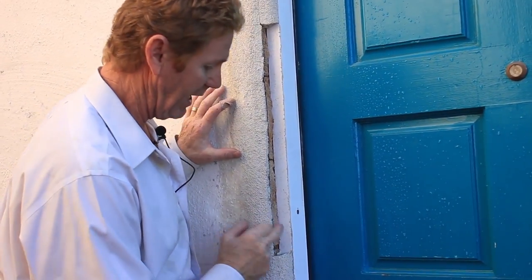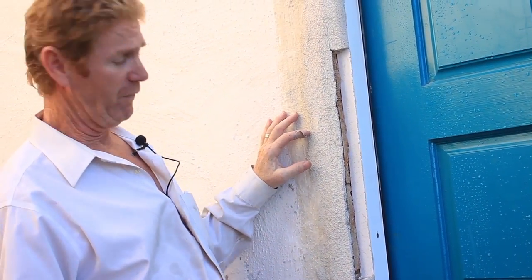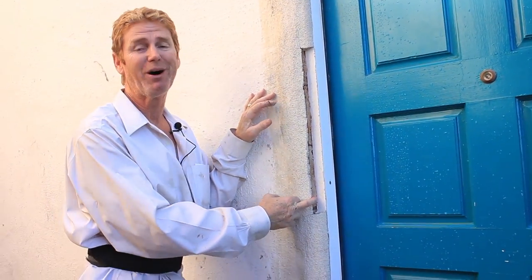Now the fellows who did this, they just put stucco and tied it in. Number one, if you just do it like that, you're going to get a bunch of hairline cracks and it's going to pop off, because that's not right. Worse off is if you apply stucco over wood with no membrane. What happens? Anybody know?